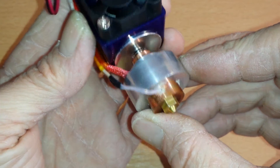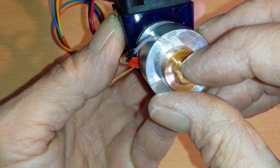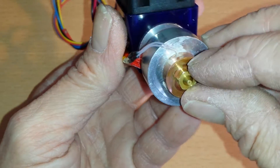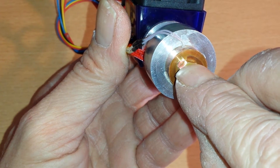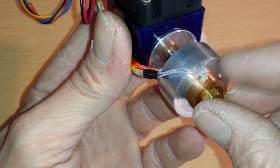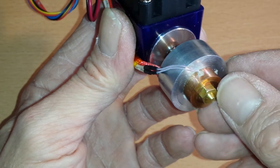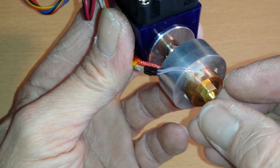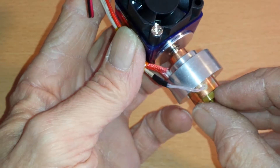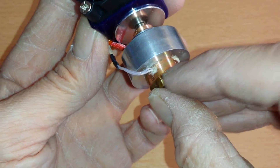There's a small hole drilled - it's not open to the inner thread, it's a blind hole - but it allows getting the thermistor right down into roughly here, which is as close to the end of the nozzle as possible. So you're reading the actual temperature at the very last point before extrusion. It'd be nice to get the temperature probe right down at the nozzle tip but it's not really practical.